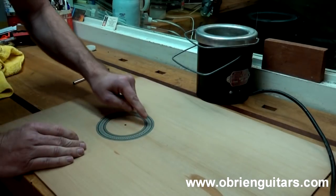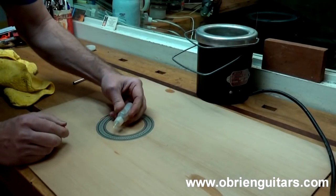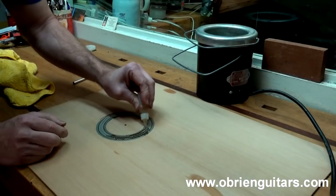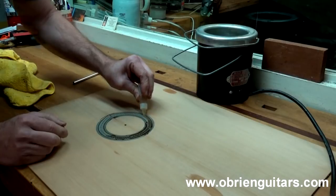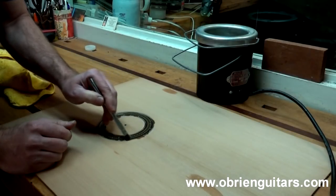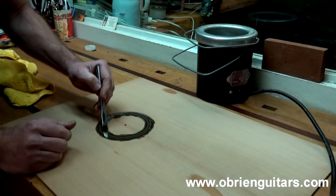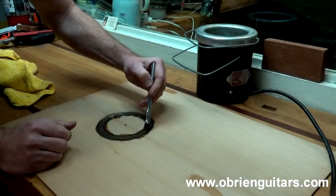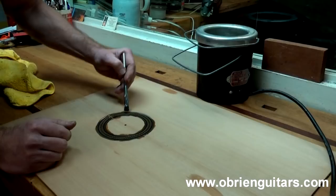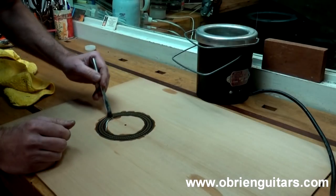I usually use this method if I know I've got these low areas before I get to finish work. Take the hide glue and just put some on the rosette. It will level itself because it's very liquid, very thin viscosity. You could also use fish glue for this — you wouldn't have to cook it, though I'd water it down just a little bit. Use a brush to level it, put it on a little bit heavy, and it will go into those low areas and do the leveling for you. Once it dries, you can just sand it, and you've got a level rosette. Problem solved.